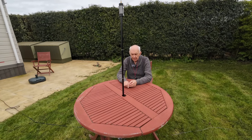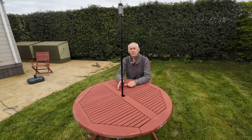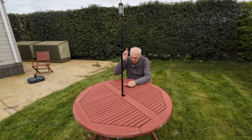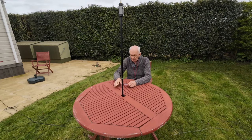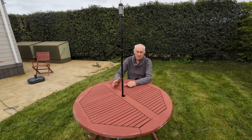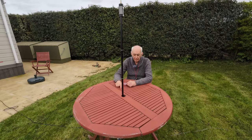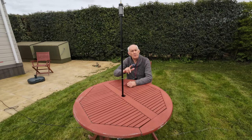How about this for a way of mounting the antenna in a very convenient place — it's a bit chilly today, but you've got a garden table with a hole in the middle to take a normal sunshade. The point is that if you've got a table with a hole through the middle, you can actually use that to poke the antenna through, so you've got your vertical antenna there and your QRP rig right there. You only have to stand up to adjust the antenna for resonance. I'm not sure about EMF — if you're running five watts you'll be pretty safe, 10 watts probably okay, but I wouldn't recommend 100 watts. So if you're going to run QRP you've got a table with a hole in the middle — stick your antenna up there. That's another idea for QRP portable Parks on the Air, though you don't often find parks with tables with holes in the middle.